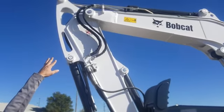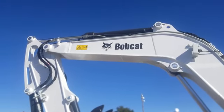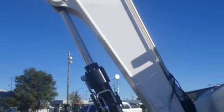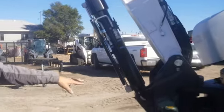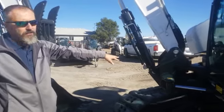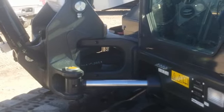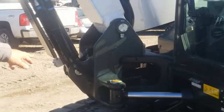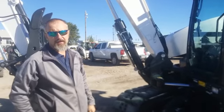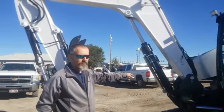You can see how all the lines are tucked in right along the top — less likely to hit them on something. Boom work lights. On the way down, protective shielding for the rams. One thing about this machine is the carriage is more tucked in than other products — when it's turned sideways and you're working along the side of a building or a tree, it doesn't swing outside the machine. Usually that ram will stick out like a thumb and is the first thing that smacks everything. Another thing — just protecting that ram and protecting the things around it.